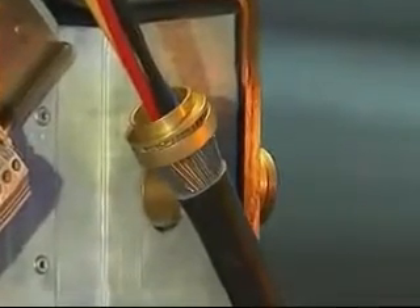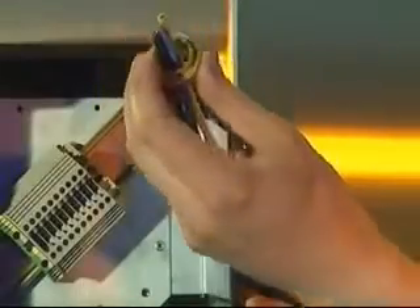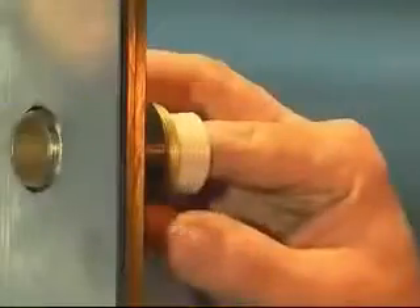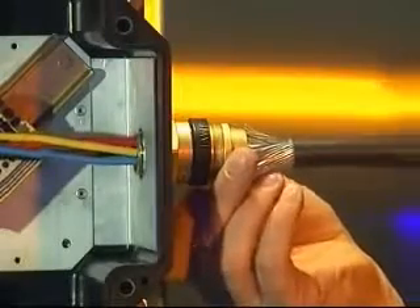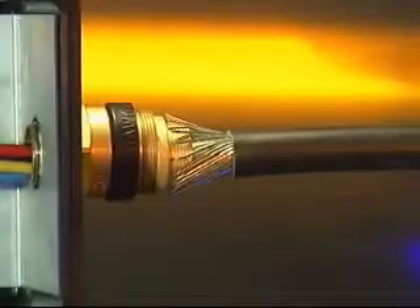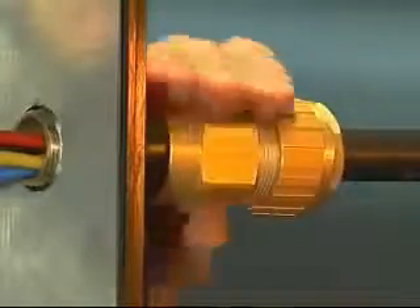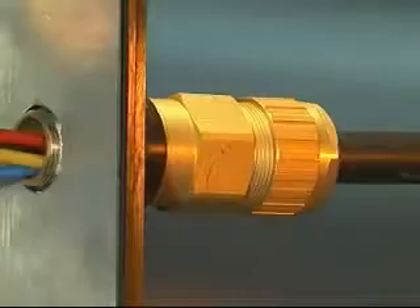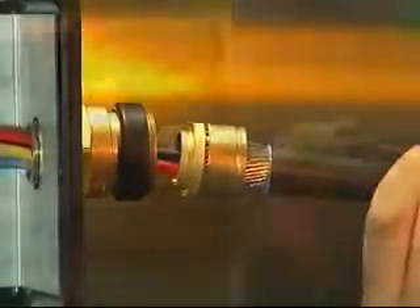For the ICG-653 Dedicated armour gland, the armour ring must be placed over the cable with the thickest part of the ring towards the back of the cable gland. Push the cable through the armour spigot and spread the armour by gently pulling it away from the inner sheath of the cable; a screwdriver may be required for larger sized cables. Remove the compound part from the entry component and push the cable through the entry component locating the spigot. Locate the spigot under the armour or braid until the ends are against the shoulder of the armour spigot. Bring up the armour clamping ring and position over the armour or braid, then bring up the middle nut and hand tighten onto the entry component. Finalise by tightening the middle nut by a further half to three quarters of a turn with a spanner or wrench to make off the armour clamping assembly. Unscrew the middle nut from the entry component and visually inspect that the armour or braid has been effectively clamped between the armour spigot and the armour clamping ring.